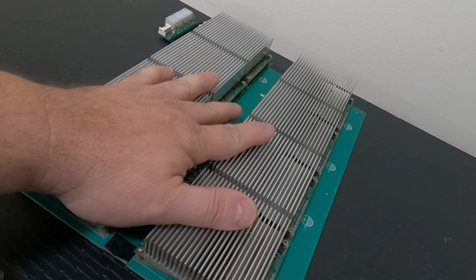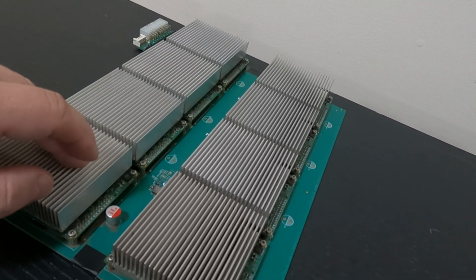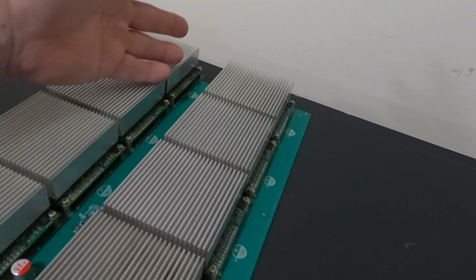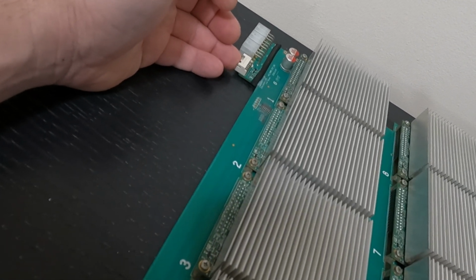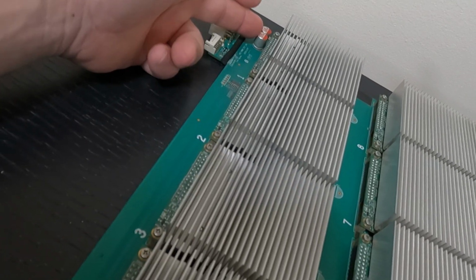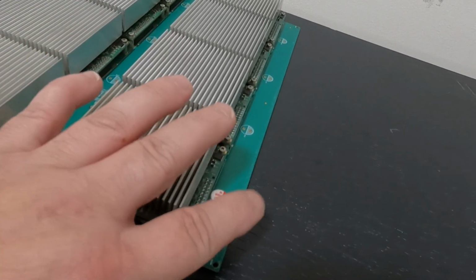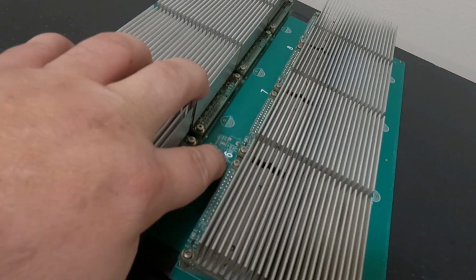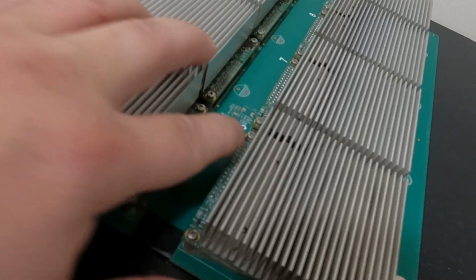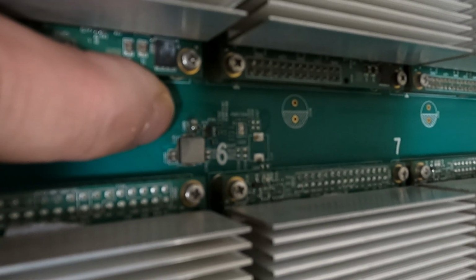So here's the offender, the bad hashboard. As you can see on these hashboards, there are 8 segments or modules, if that's the way you want to put it. You got your 3 6-pin powers up top here, your data cable that runs out to your controller, a few caps up here, and there's like 2 caps here, and that's it. The rest of them aren't even populated. There's this little DC converter sitting right here in the middle. God knows what for, but hopefully I can get in there. There's a bad capacitor in there.